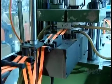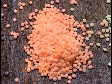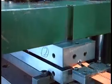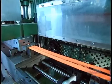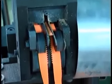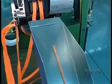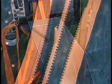Plastic zippers are made quite differently than metal ones. The tape is the same, but the teeth are made from plastic pellets. A machine melts them, then injects the liquid plastic into a mold in the shape of a strip of zipper teeth. The mold cools almost instantly, hardening the plastic, and the machine stamps the teeth onto the tape, automatically gapping the desired zipper length. The excess plastic in the middle is remelted. Workers mesh the two halves of plastic zippers manually so they can inspect the teeth, then automated machines install the remaining components.